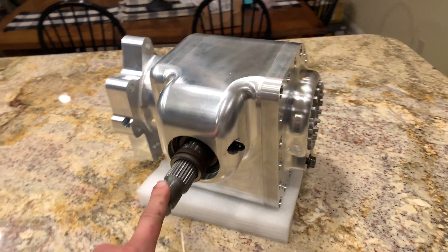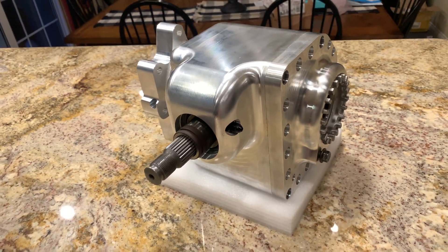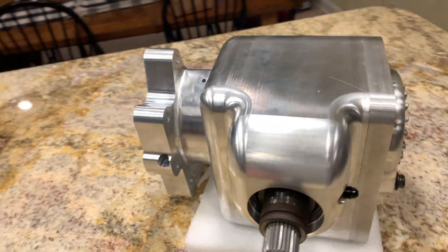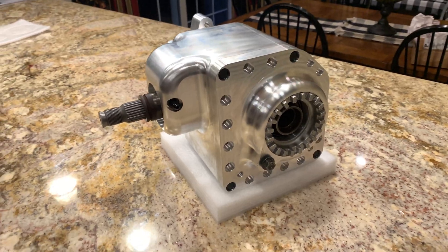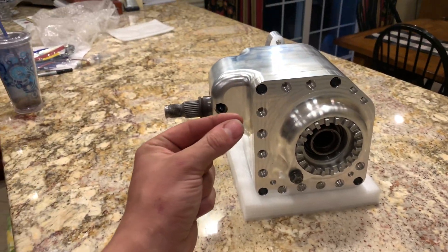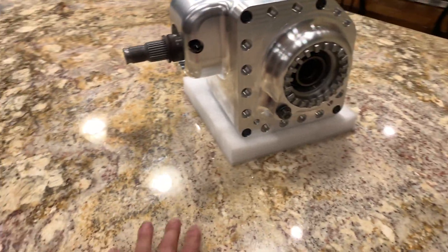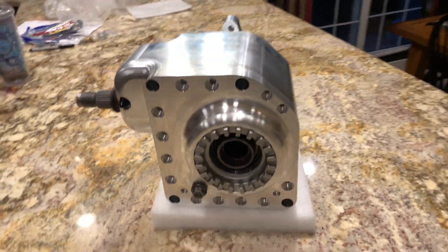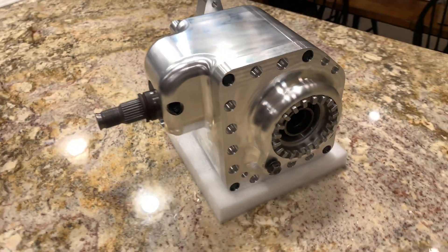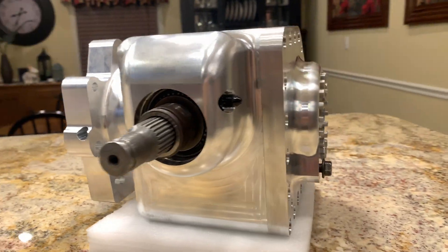Next, basically I'm going to pull the gears — probably next video — out of this thing and out of one of my donor angle gears. Then we'll start buying all new bearings and everything and really start putting this together. Because we're going to have to figure out what kind of shims we need. I don't really think we're going to have to change the shims too much — we might be able to get away with just sanding them, decreasing the shim thickness on the ring gear with a really fine grit sandpaper. I did a little bit of gear marking compound on the ring gear and it was pretty close — I think it's going to get better when the backlash comes in a bit.